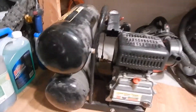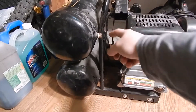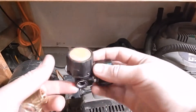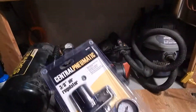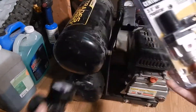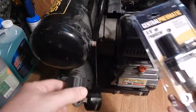That's simply because of how much hose I have. My hose goes up and over to my hose reel, so I've got quite a bit of hose. Once it uses the pressure in that hose, I wasn't getting enough pressure out of the tank to keep it feeding. I might have had 110 or 115 psi at the tank but it couldn't make it out.